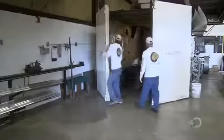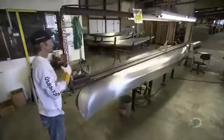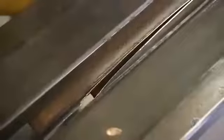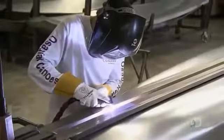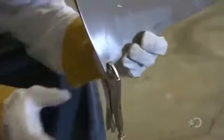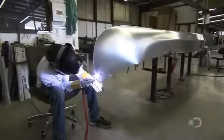They bake the hull halves at 200 degrees Celsius for eight hours. The heat strengthens the aluminum and adds rigidity to it. Out of the oven now, a member of the team aligns the two halves. It's a perfect match, so he now lowers a large clamp. Once in place, he turns a crank to pull the two parts of the aluminum canoe together. Tightly clamped, he welds the two parts along the bottom, joining them with a watertight seam. With hand clamps, he tacks the two rounded ends together and welds there. He links the end welds to the one on the bottom, and the result is one continuous leak-proof weld from bow to stern.